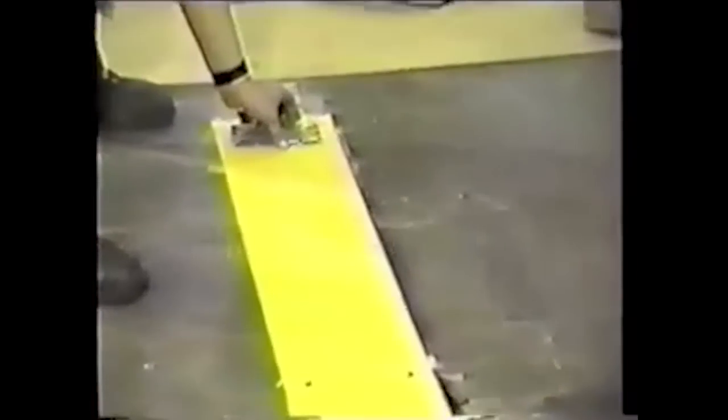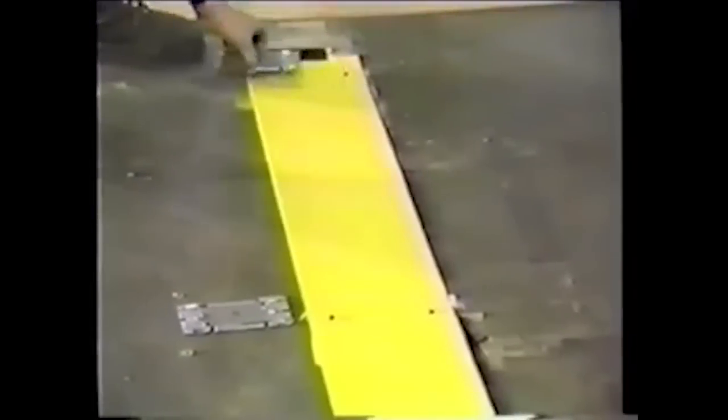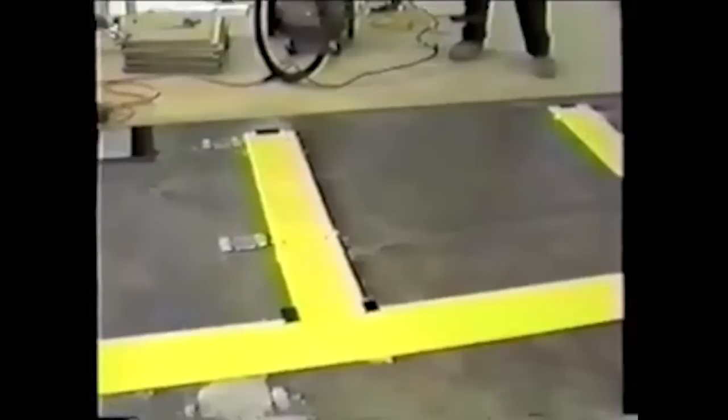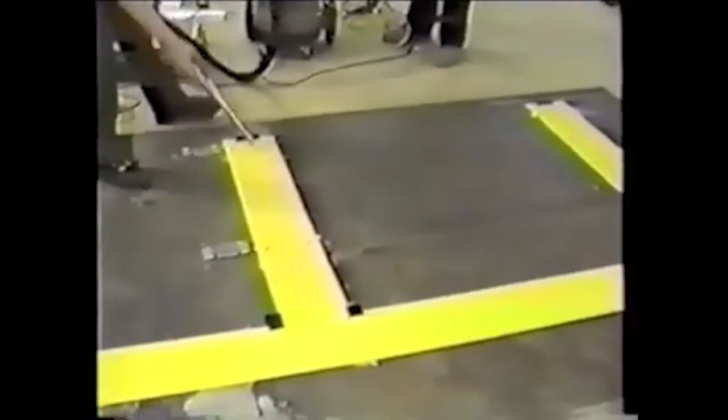Locate and position the floor fitting base plate selected in the location specified and install the mounting anchors. If vinyl floor preparation is required, drill and install the anchors through the vinyl. If the vinyl floor preparation is not required, install the base plate mounting anchors directly to the floor. Set the base plates aside to be installed after the cable has been rolled out into position. Be sure to remove all debris generated during the drilling and anchor installation process.